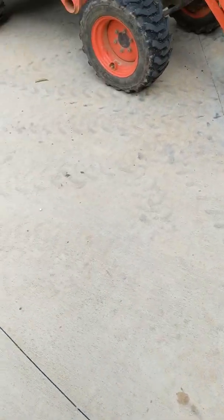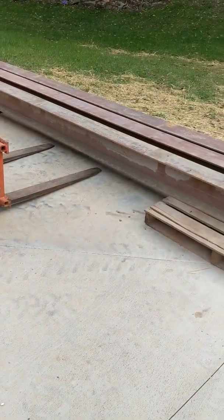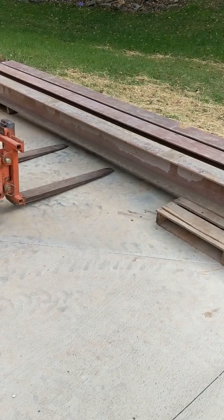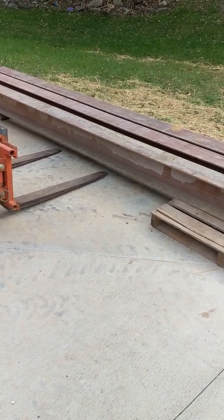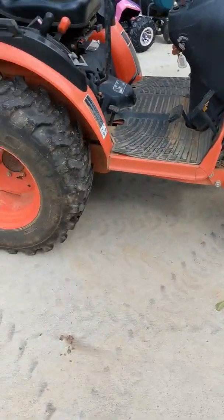I was going for a max of a two-ton lift, stretching it. The bridge crane itself, just from looking at what one of these beams will support in configuration, I'm seeing five and six tons worth of support — which is way overkill for what I want to do, which is fine. The goal is just to be able to pick up 1,000 to 2,000 pounds at most — a mill or a lathe or something, putting it on a trailer or bringing it off a trailer. Maybe something heavier.